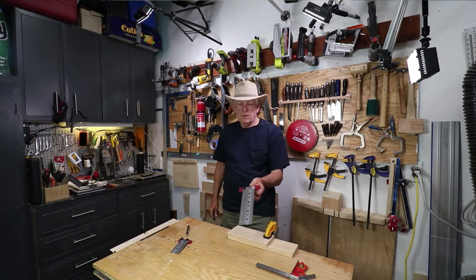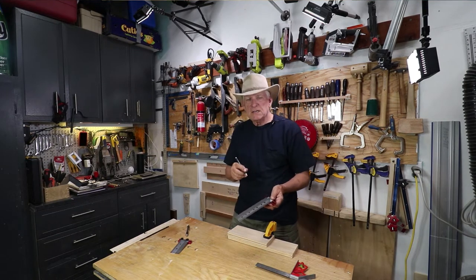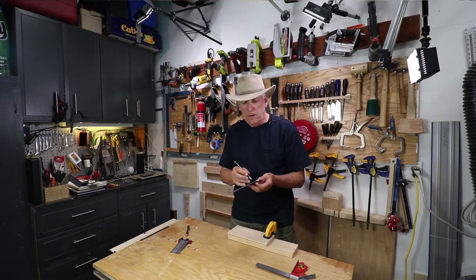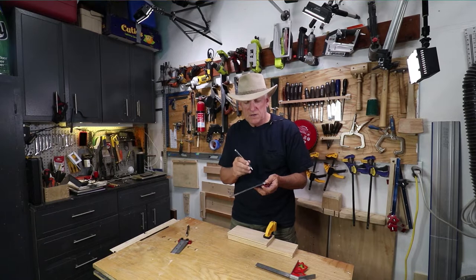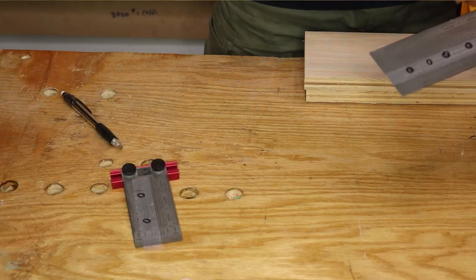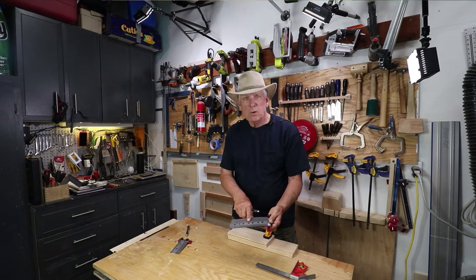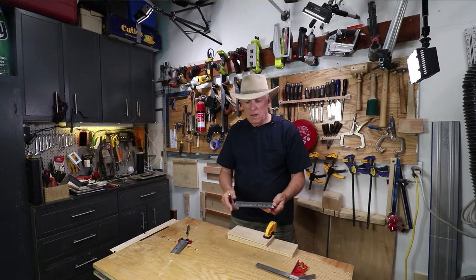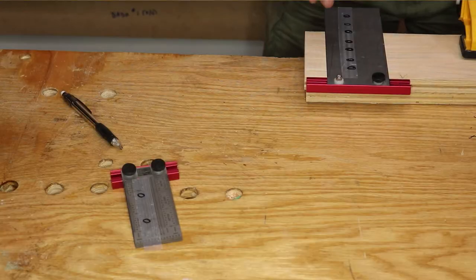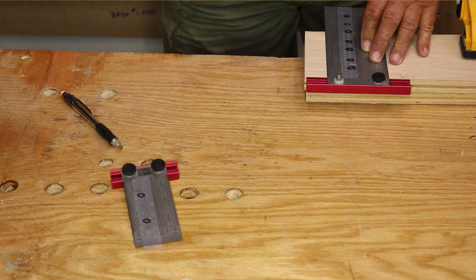Put a piece of scotch tape on your INCRA, and then I used just a scribing knife to go in for where I need each of the consistent layout marks. I went in and pierced that scotch tape and drew a circle around it to make it easy to see. So I did one here that was seven-eighths from the edge, then three-quarters, then one inch, then three-quarters, then one inch — with only those holes having been perforated and very visual to me.